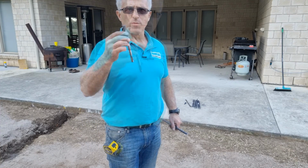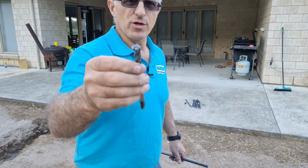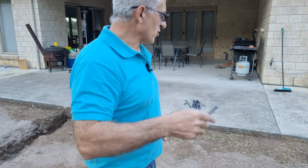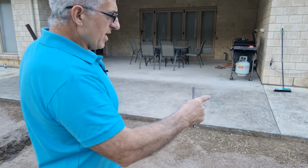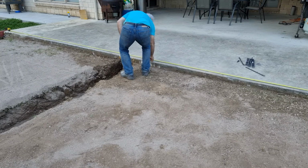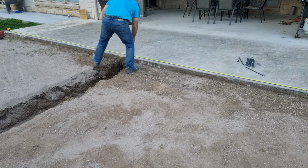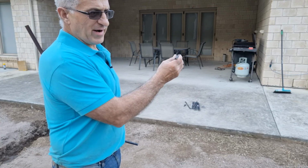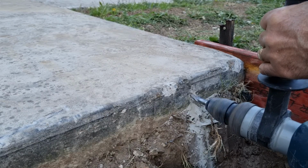Now I'm going to use my Bosch hammer drill, and I'm going to use this masonry drill bit, which is a 12 mil, and drill into the concrete slab, coming from each end, 200 mil, and then 500 mil spacings between them. And so I'm going to drill 50 mil down into the slab and drill straight across as far as I can with this drill bit.